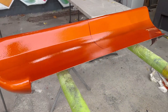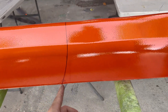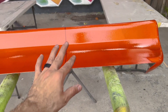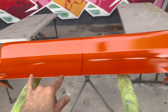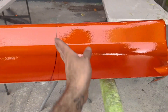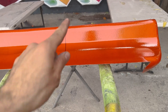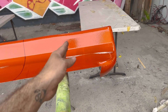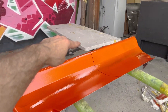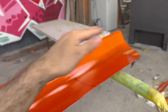We got both molds released, we have them clear gel-coated, and before I gel-coated I marked the center line and the weave orientation. We're going to take that stabilized carbon fiber from Fiberglass Supply and run a single piece here with the weave running this way — and the same thing this way — because it's going to match our trunk floor. So it'll go straight through the trunk, up this hump, and we're going to do the same thing on the inner section. We've got a couple parts to lay up, and we're also going to lay up a flat panel on a piece of glass for the inner sections of the quarters.